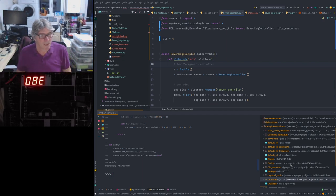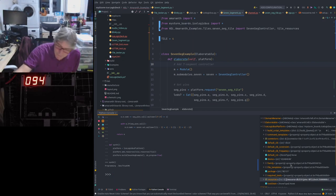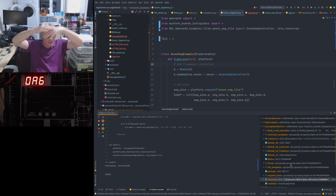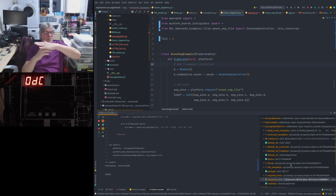If you remember from last time, the problem I had when I constructed the ICE logic board is it's a double-sided board, so you've got all the kind of clever components on the top, such as the ICE40, the switch mode regulators, the series resistors for damping the lines, or impedance matching the lines, and the upper connectors for the mezzanine. But the tiles connect on the bottom side. There's also some decoupling stuff underneath the BGA.